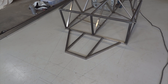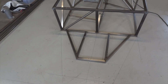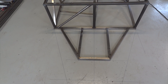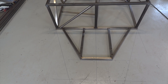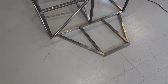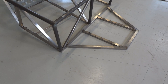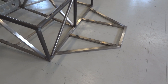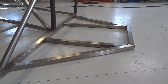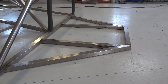So there's that lower rear frame tacked in place, and also a couple of almost longitudinal bits that are actually off to the right at one degree, because the final drive sits at one degree to the car center line — or 89 degrees to the car center line — because the engine is angled across at one degree. You can see the little holes in the back for the final drive mounting plates.